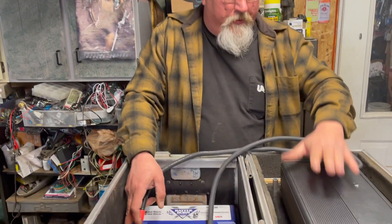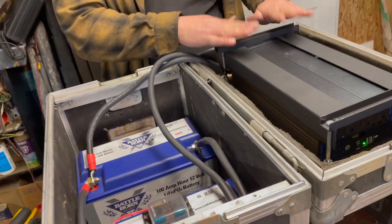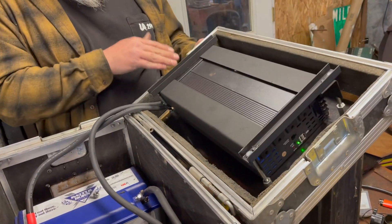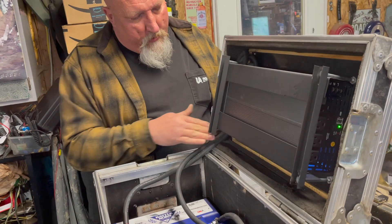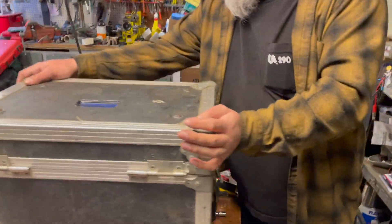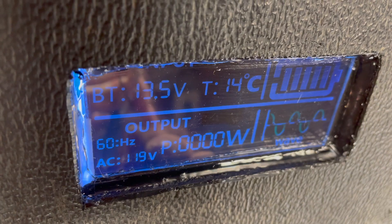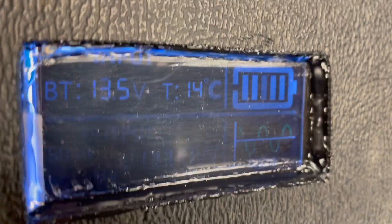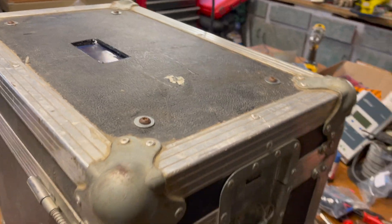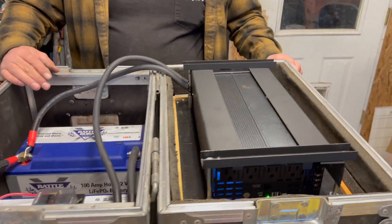I'm going to tighten this up, put the frame back on the inverter, and then we're going to test the inverter. That turned out even better than I thought — we've got the wire secured here, the inverter secured here, and it just folds up nicely. I didn't want any strain on the terminals, and we secured it with zip ties. Up here at the top we have our display — I can tell my batteries have 13.5 volts. It's 14 degrees Celsius inside. Right now we're not putting out any wattage, so we're going to plug in a heat gun and see what happens.